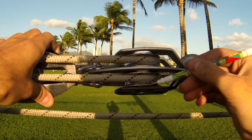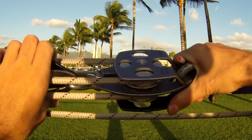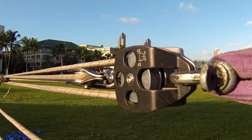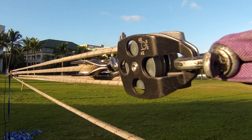On this side it's correct, but the other side is misaligned, and in doing so the sheave runs against the side plate, which creates tons of drag. Tightening and detensioning is very noisy — these bushing pulleys are quite inefficient.